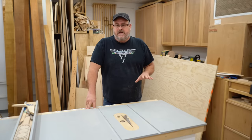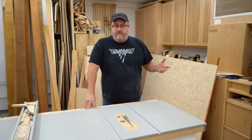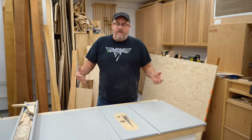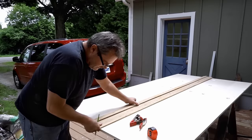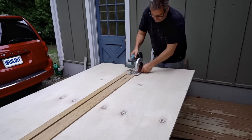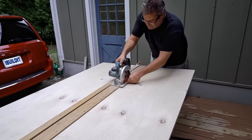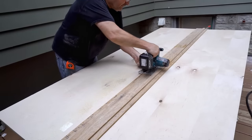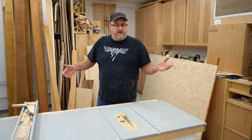Next I want to talk about cutting larger pieces on the table saw. I'm going to cut that sheet of plywood that's right behind me — a full four by eight sheet of three quarter inch plywood, which is something I almost never do. Instead I take it outdoors, set it up on sawhorses, use a sawboard and my circular saw, and make an initial cut to cut it down to something more manageable — either a crosscut or a rip cut — and then bring it in and do the rest of the cutting on the table saw because the pieces are smaller and easier to handle.